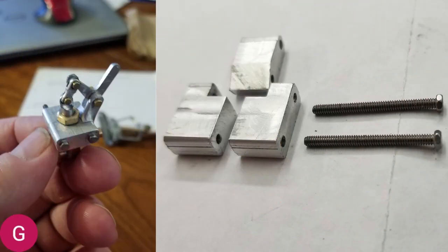Okay, this little part is the fuel regulator valve. It acted like a variable needle valve because on the throttle, the pilot actually had to adjust the air on one part of the throttle and the fuel on the other. So he's the one that set the fuel to air ratio, and this valve set the fuel flow into the air box of the engine, since the engine really did not have a carburetor.